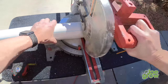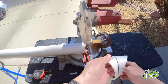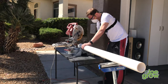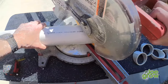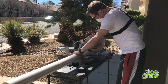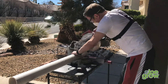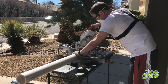Here are a few tips when cutting PVC with the chop saw. First, if you don't have a vacuum attachment for your chop saw make sure you cut PVC outdoors and wear a mask — the white plastic dust goes everywhere and you don't want to breathe it in or track it inside your house. Also be sure to go slow with your cuts and let the saw do the work. Note that you have to switch the cut angle between zero degrees and 30 degrees between each cut. In all it took about 10 minutes to make all these cuts — it actually took me longer to set up the saw and guide than it took to cut.